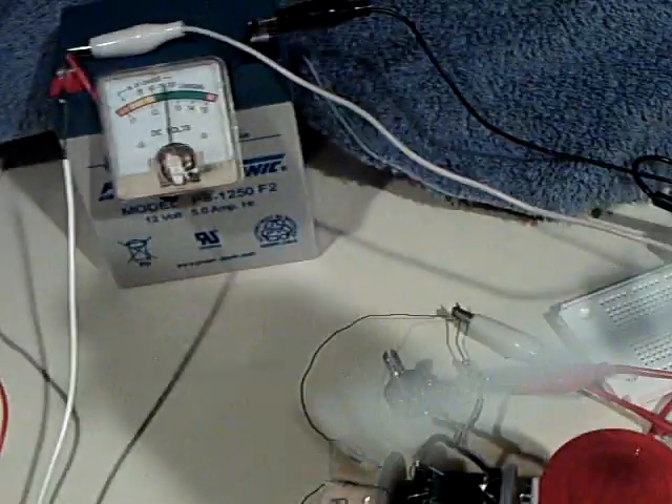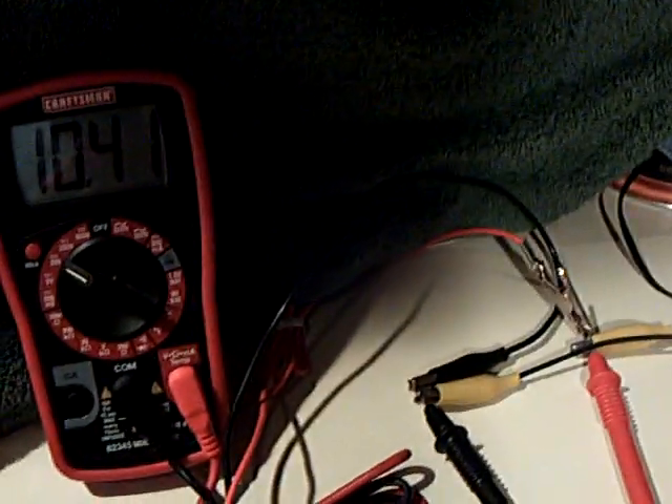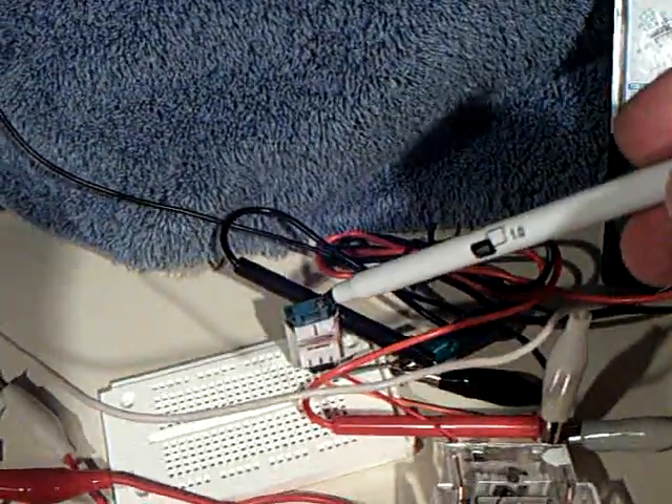I'm probably 10 to 15 milliamps in, and I'm coming out with about five of that — the rest is eaten by the circuit. That's okay because this thing is running and I don't mind as long as I'm getting light out of the system. What was a real pleasure to see was that I can charge the system while it's running — that's something I wanted to verify. I just plugged in the battery right here and you can see the battery has locked the system at its voltage; this will climb because I have a higher voltage coming out of the capacitor. I've got the light going, the battery hooked up and charging. I can increase that by dialing in more over here — this is the gas pedal, the accelerator. Step on it and you put more juice in; ease up and you ease up on the source.